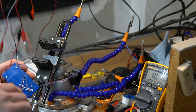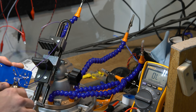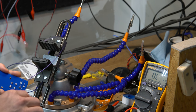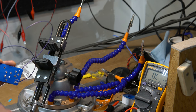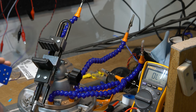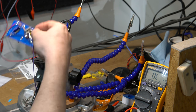See how I just had a wire connecting between two points? All of these need to be snipped and cleared, so that we don't accidentally jump or anything. All right. Get a little bit more of the ugliest stuff up. All right, so now we're clear. Everything looks well cleaned up. And now we will try testing our resistances.